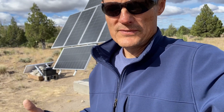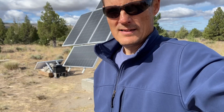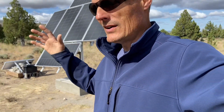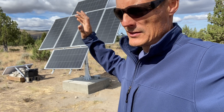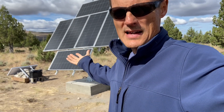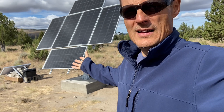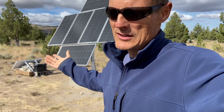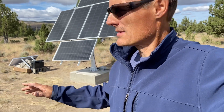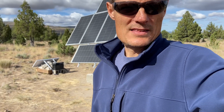Even though the new EcoWorthy panels are fairly cost-competitive, there are cheaper solar panels out there, and the price per watt is a little high in my opinion. I went with them because I wanted the total package since that's what the mount is designed for. People are putting different panels on the dual axis tracker, but you have to be careful — if you go too heavy, you'll have to upgrade your actuators. Don't put something heavier than the 195 watt panels; lighter is probably fine, but heavier will cause problems.